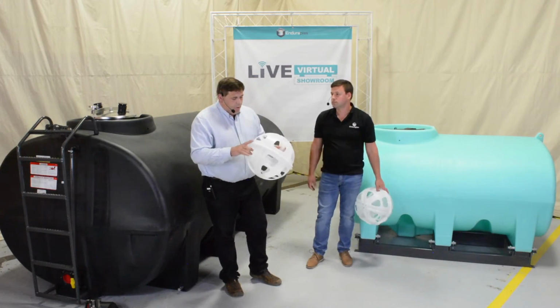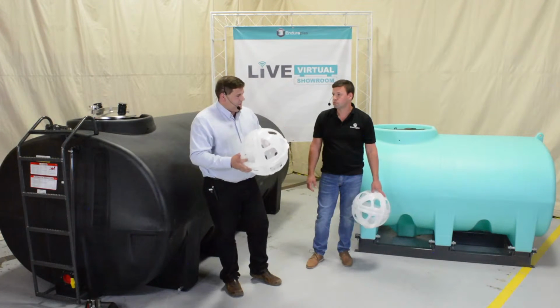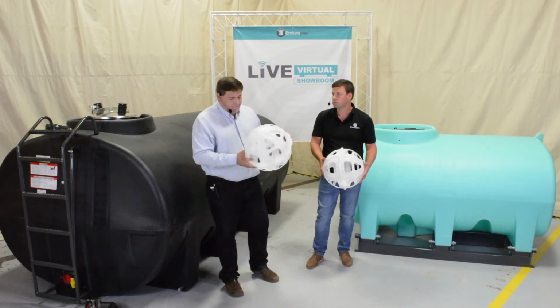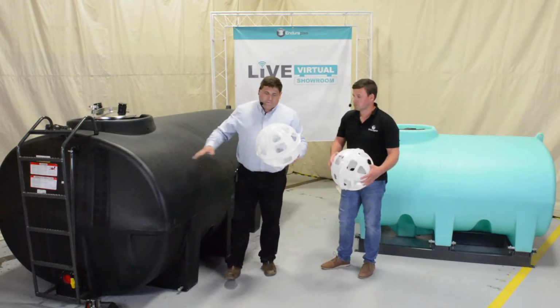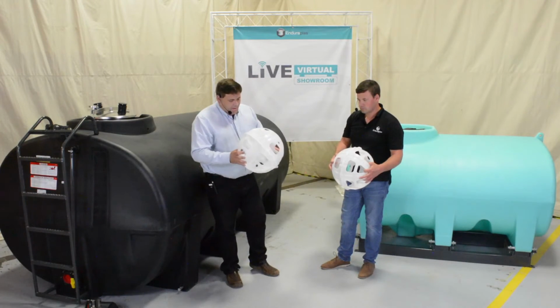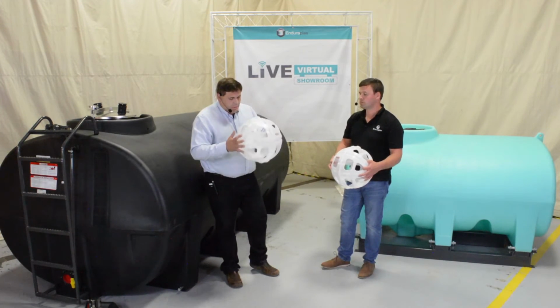The baffle ball, first of all, people say, how many does it take? Well, obviously, one ball offsets 10 gallons of water. So in a 1,600-gallon tank, you're going to need 160 baffle balls. On a 550, you're going to need around 53, 54 of them, something like that. But the way it works, you fill the tank plumb full.